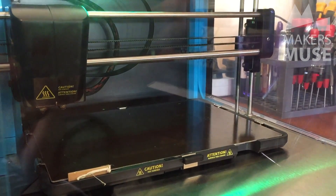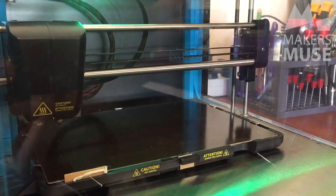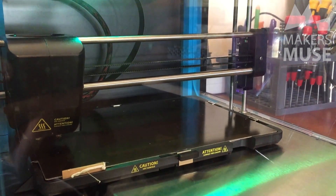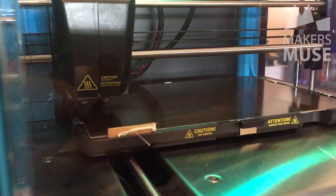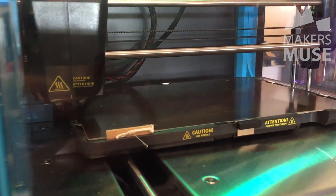The smarts don't stop there — you get automatic platform calibration and it actually works, take that MakerBot fifth gen. It moves around the platform point by point, quickly works out where the platform level is, and does the touch-off so you don't have to use a business card ever again. There's no Z-axis offset fudging — it just works. That's one of the things I've never seen in a printer out of the box before; you literally never have to re-level it and that's awesome.